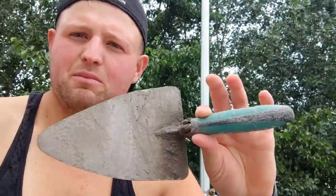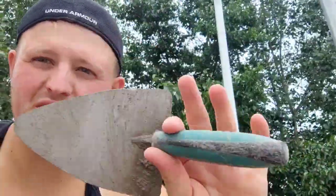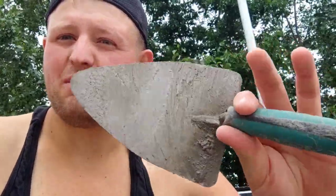This is the trowel I'm still using. I've got another trowel. This is like my pick and dip trowel and block work trowel. I've got another trowel I use for clay bricks, long spread. It's a bit bigger than this, but I use this pretty much 60-70% of the time at the moment. It depends how I'm feeling, it depends how the gear is. If the gear's stiffer, I'm using my bigger trowel. I'll show you that in the coming videos. I'm experimenting still with that, so I'm not going to put it on YouTube if it's not something I'm fully on board with. But this is definitely a cheap, accessible trowel. Bucket trowel, cut down. I'm going to modify this a little bit. But yeah, check it out.